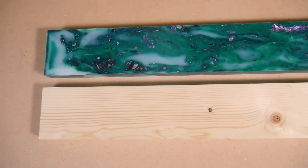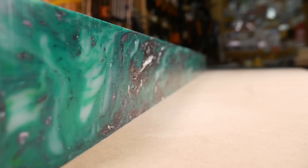This beam is one meter long, but seeing as it worked so well we're quite tempted to just make another mould and see how big we can go. The main drawback to this whole process is time — it took the two of us around three hours to melt 1.8 kilos of plastic down and turn it into the beam. We're thinking with a few more panini presses you could definitely do this quicker, but it would be great to hear if you have any ideas for making this more feasible.